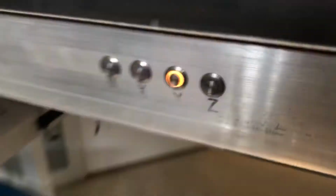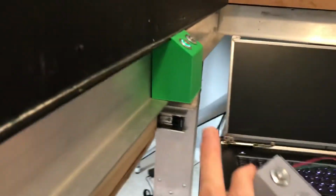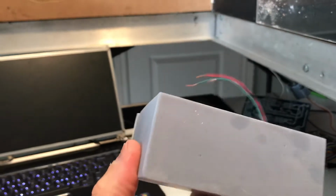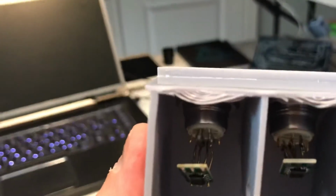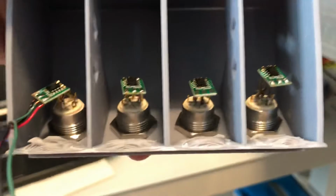But these are harder to see when you're up here at an angle; you can barely see them. So I ended up buying a resin printer. This one is done a little bit smoother than that one, because that is filament, which goes back and forth, and this is resin that's done in liquid. The liquid starts off obviously as liquid. The only thing is that you can see over here it sags a little bit because this is actually printed upside down, and I would have to make supports in the box here when I install it.